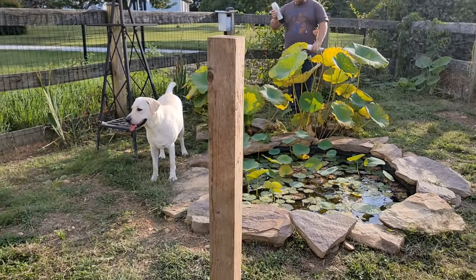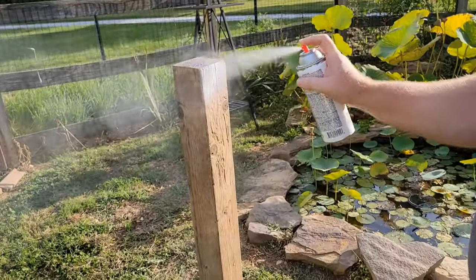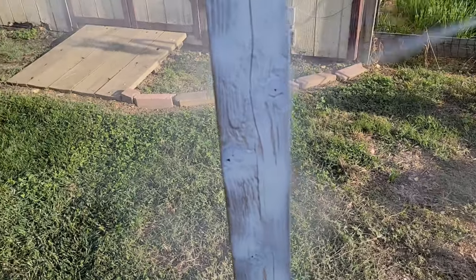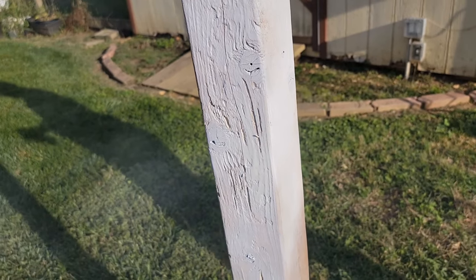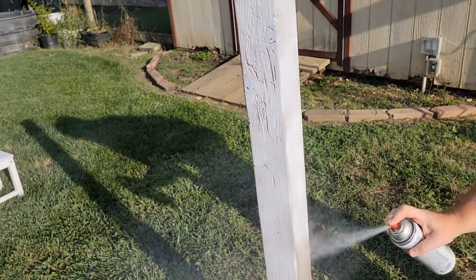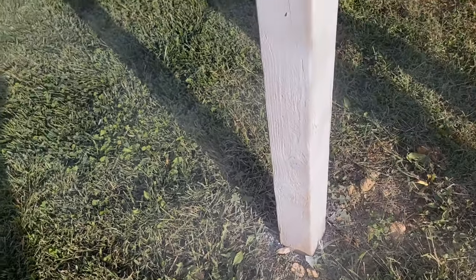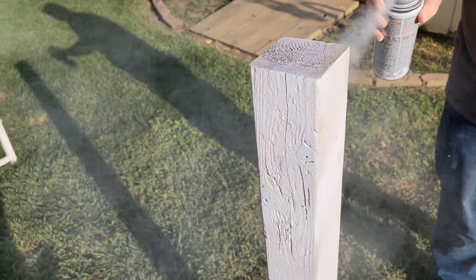The wood is dry and we are going to paint it white. We're going to hit it with more than one coat. The first coat is going to go on a little light because wood is very absorbent and it's going to soak a lot of this paint in. The first coat will act as a primer — it'll soak in, but when it dries it makes the second coat go on nice and even and thick. Wear a mask, or be outside in a very well-ventilated area.